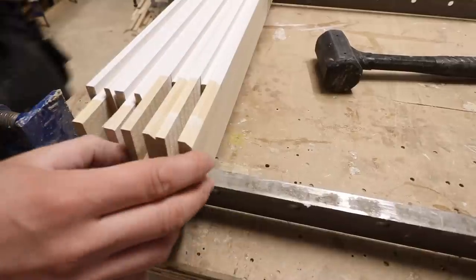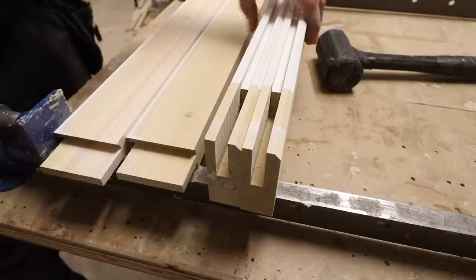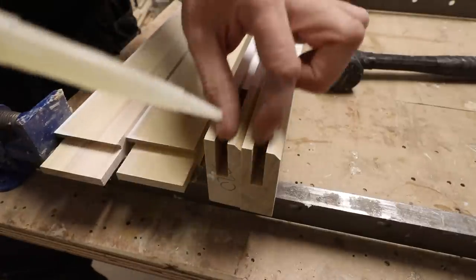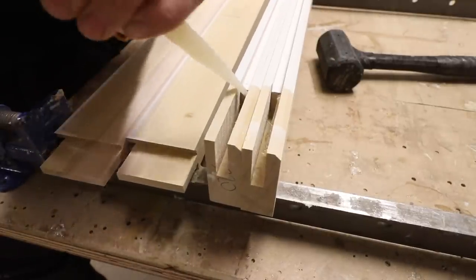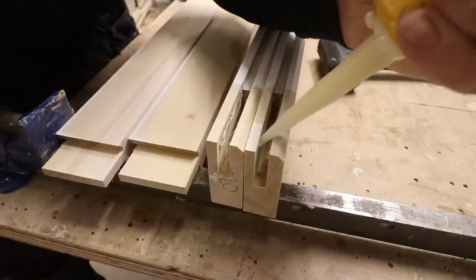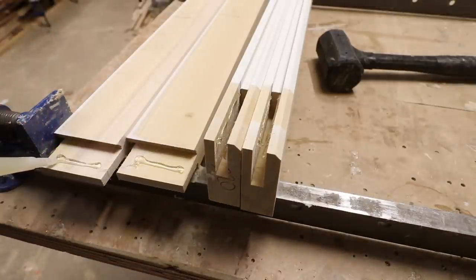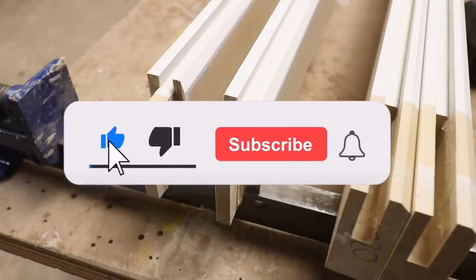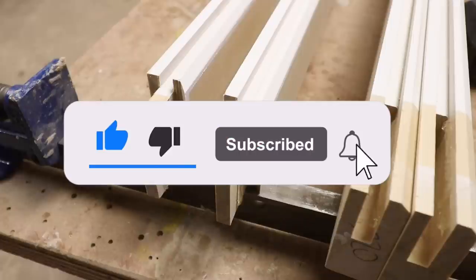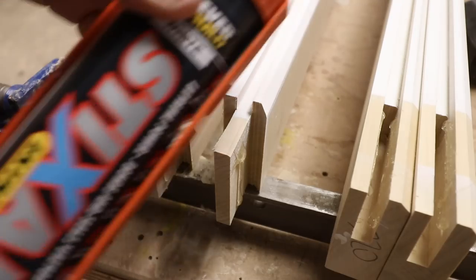What I tend to do with polyurethane glue is I don't glue every part of both sides of the joint. I'll take my PU glue and in the mortise I'll do a thin bead each side. Then on the rails I'll just put a bead the same on the flat of the tenon. Then I'll use a spatula to spread the glue. But before doing that, the important step to stop the glue squeeze is to use a cork of some kind.